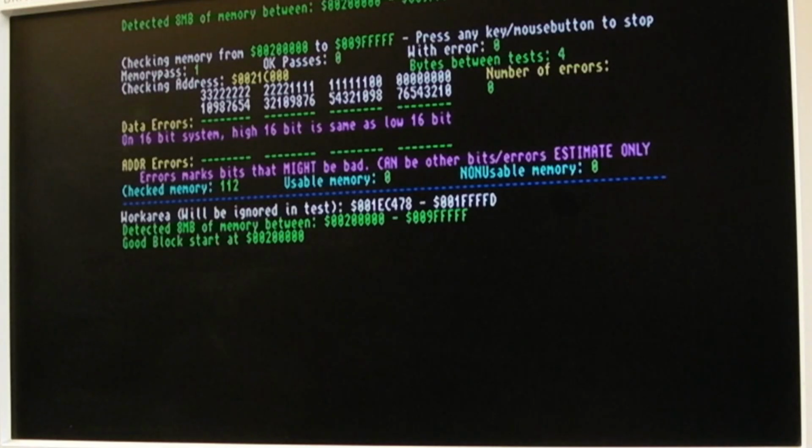But you see, the thing is, those two resistors are not documented on my revision. I've got the manual that ships with, I don't know, Rev 0 or Rev 1, and it doesn't mention those resistors. It doesn't even tell you what size resistor to fit there, I don't think. I think there is a resistor size in the BOM. So then you've got to question, why do we have that flip-flop underneath in that resistor? And because it goes to the FPU socket, I do think that's what it's intended for.